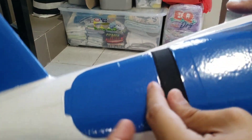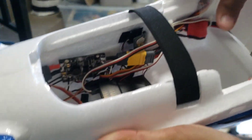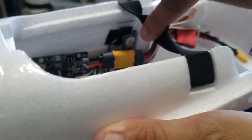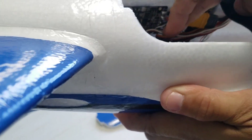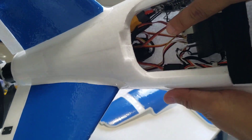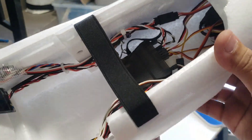To open this part, lift the strap a little, use your hand to pull the tape out. Here's the power module, a Pixhawk Lite, and of course a lot of wires and servo connections. I have the Micro MinimOSD here, and the Matek 5-in-1 PDB to facilitate power supply for the camera and VTX. I'm using a HobbyWing 40-amp ESC — that's a Flyfun V5 ESC which provides 5V 8A supply to the servo rails of the Pixhawk Lite.